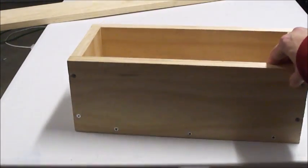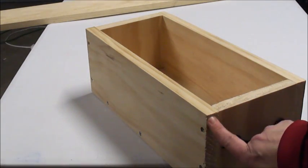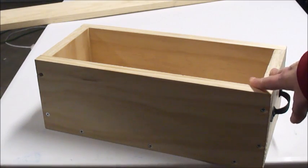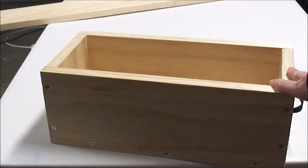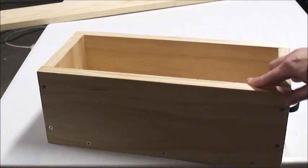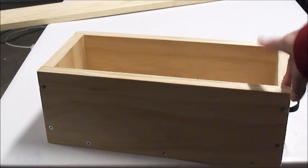And we realized that it is very important that you make your cuts as straight as you possibly can. Obviously, we don't have any expensive major tools to do that, so we experimented a little. We used a handsaw and a jigsaw, and although we felt like we had more control with the handsaw, it did leave a little bit of jaggedy marks on the wood, which was really no big deal, but I actually liked using the jigsaw. So we're going to use that in this video, but if you don't have a jigsaw, you can use a handsaw just as easily.